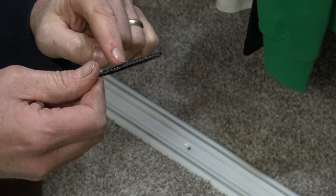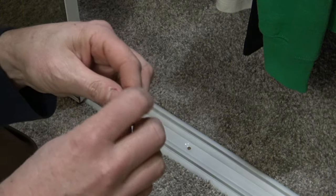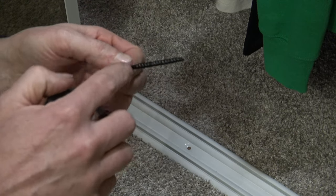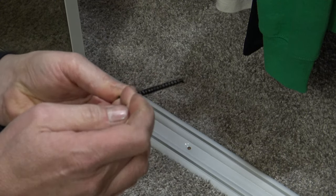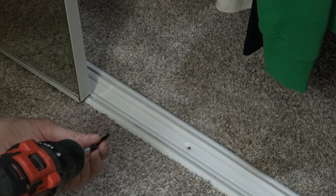You can get it kind of stretched tight. You don't want to put like two or three layers — you want this pretty well thin on there. With the electrical tape, you can kind of pull it and stretch it, and you will actually see where it goes down into the grooves. You just want to make sure that all the threads are covered. Now we can go ahead and sink the screw.